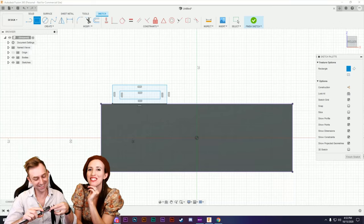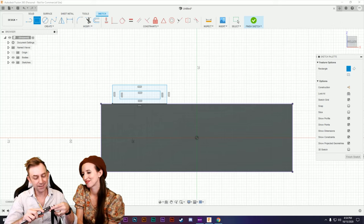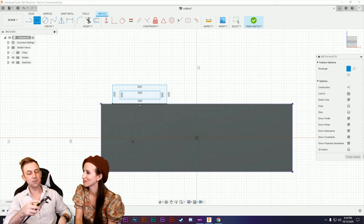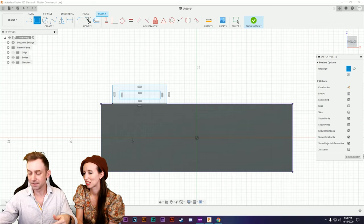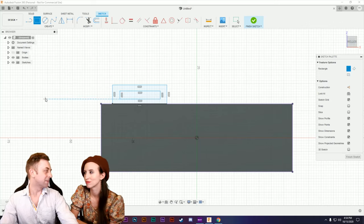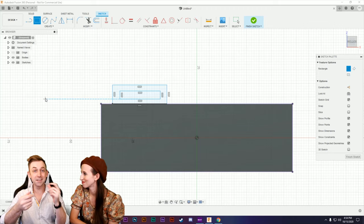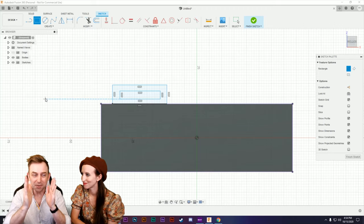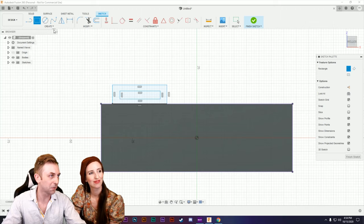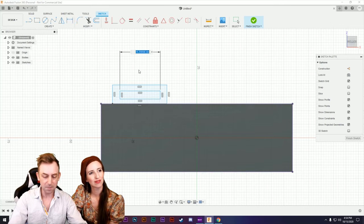So, pearls of wisdom from Alex Holmstead. Okay, so if this is a 19 millimeter wide strap, let's just make it an even 20 millimeter slot. That'll give a little wiggle room and make it easy to put in. We imagine that on the assembly line, it's a lot easier to quickly put a strap through a bigger slot than a smaller one. So we'll do sketch dimension on this line, and that's going to be 20 millimeters.